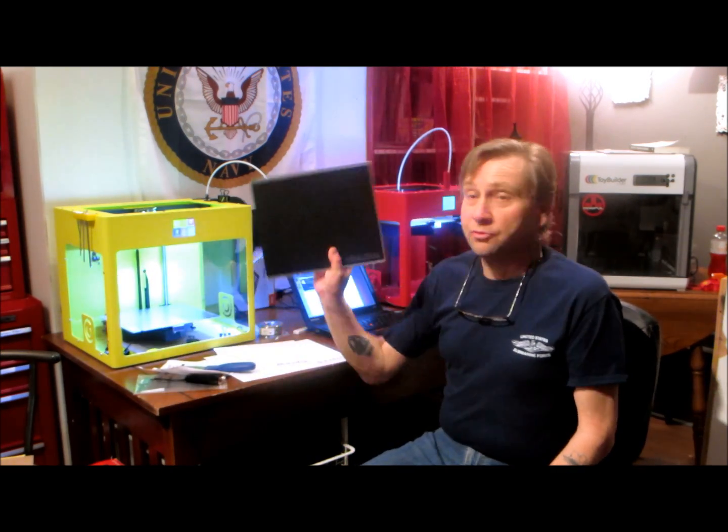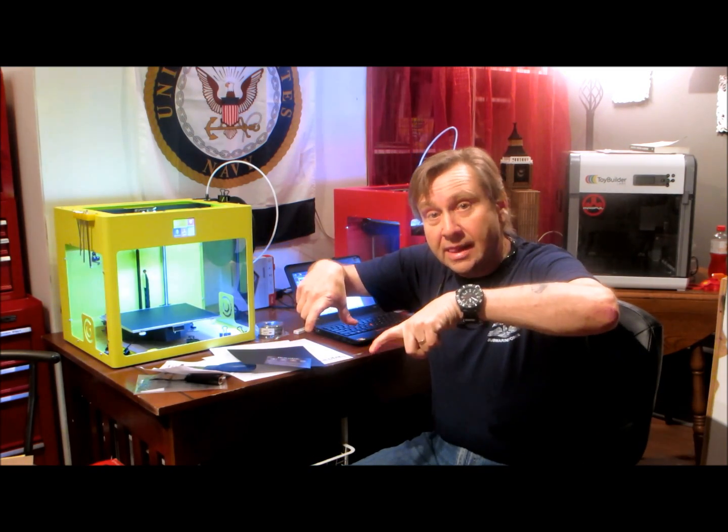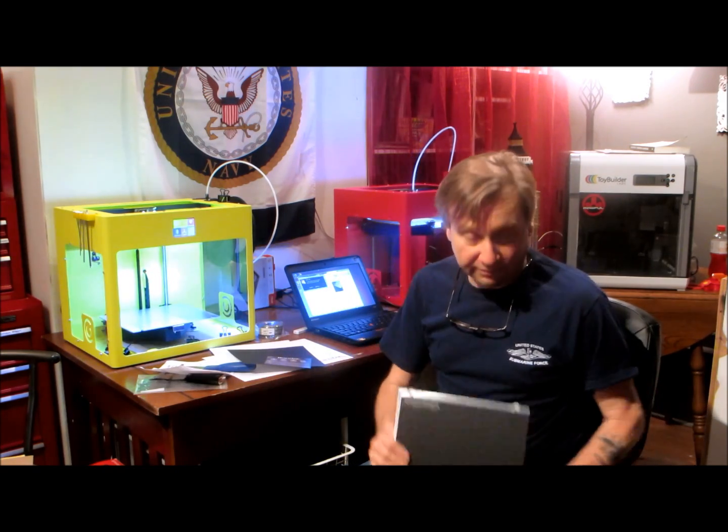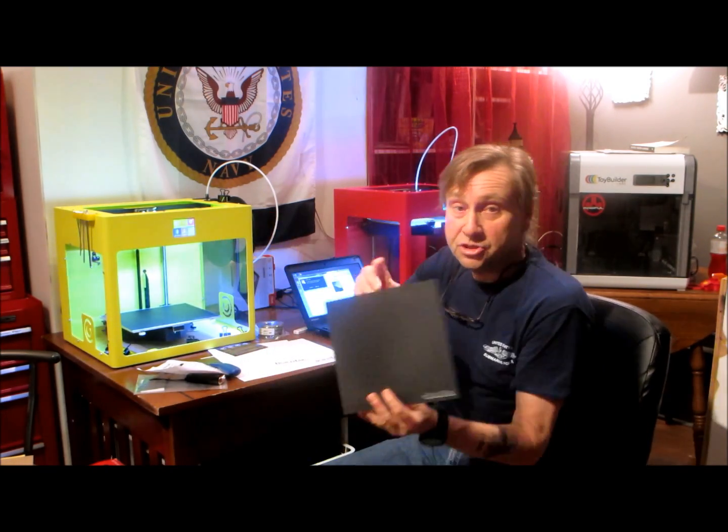I got one of each of the sizes I want to try. One size was for my CraftBot — I've already put that on the aluminum build tray and took the Kapton off. I've been using glass. On my DaVinci, I replaced it with some heavy Kapton and I'm having problems because the DaVinci has a captured glass on top, so the Kapton sheet wants to pull from the corners and you get wrinkles. I'm going to yank that Kapton off and replace it with a BuildTac sheet.